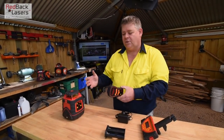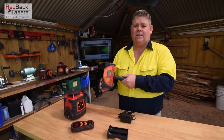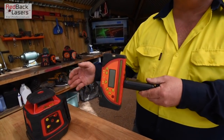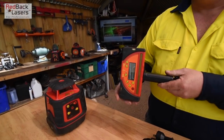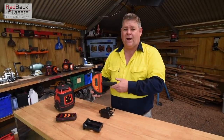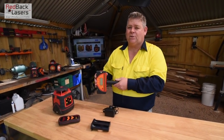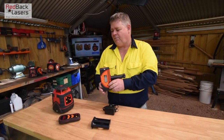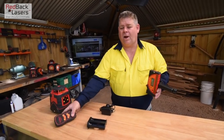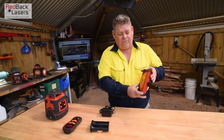We've got videos on each of those features for that laser. The big plus with this laser is the LR720T tracking receiver. That receiver talks back to the laser when we want to set a grade. In normal operation it's going to read up to 45mm above or below our level indicator, so if we're doing ground works and we're within 10mm, we're going to see that straight up on our receiver. But if we want to set a grade on that laser, rather than setting the manual grade off the remote control, we can now auto track a grade off our receiver.